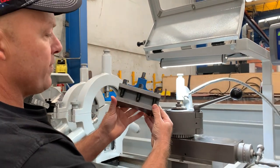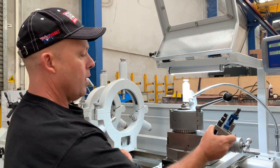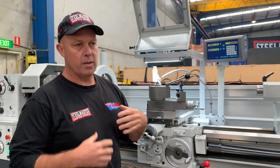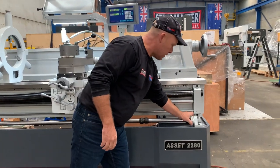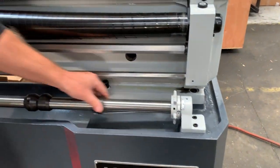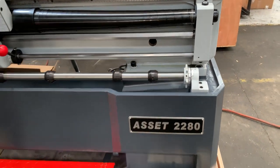The tool post will take 25 and 32mm tools. Being a heavy duty lathe, we supply three of those tool holders with the machine, but we've got stacks of others in stock and a large accessory stockage here. On the feeding system, we've got the indexable feed knockout system — you can set these feed knockouts anywhere along the position and it knocks the feed out as you're going.